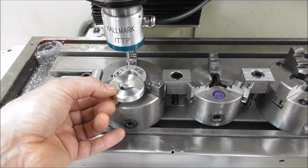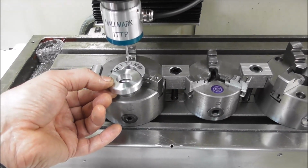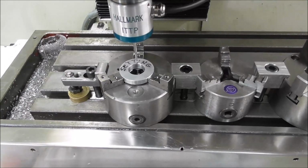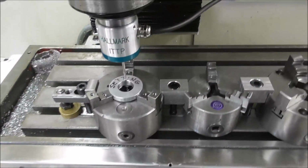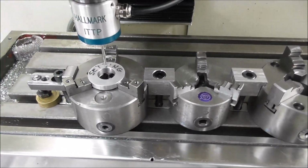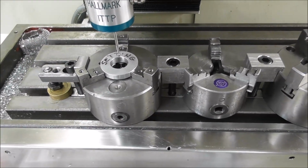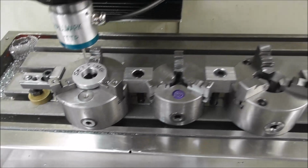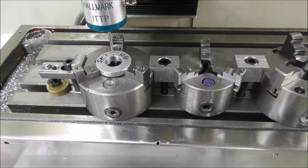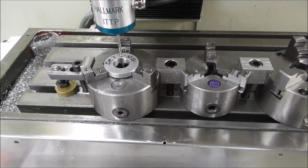And you think, oh God, that's going to take days. Well, you start thinking, do I need a tool changer? Well, of course, you've got another option. Instead of having an automatic tool changer, you can have multi-stations for your parts and put in multiple parts so that the program runs automatically from one part to the next, and that is, all things being equal, just as efficient and just as big a time saving as having a tool changer.